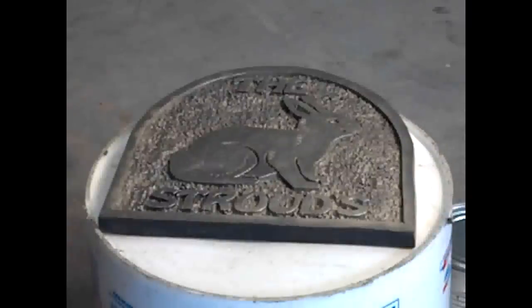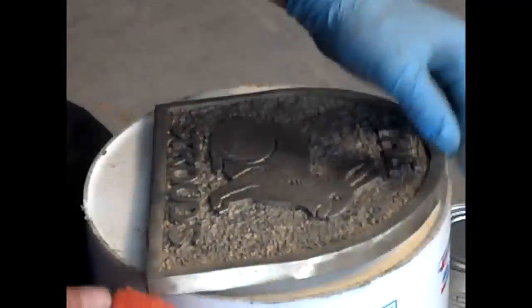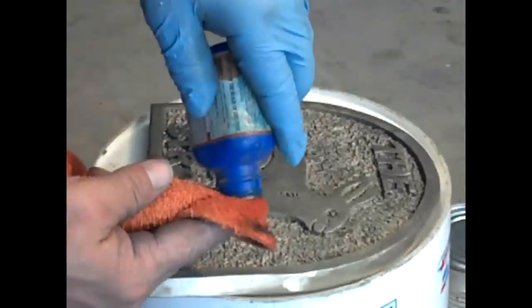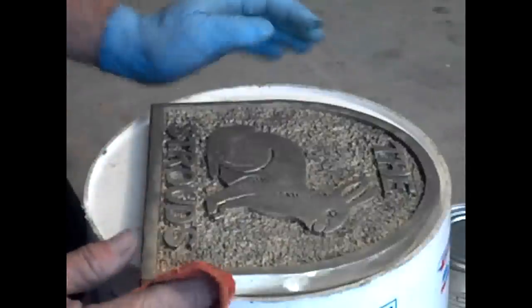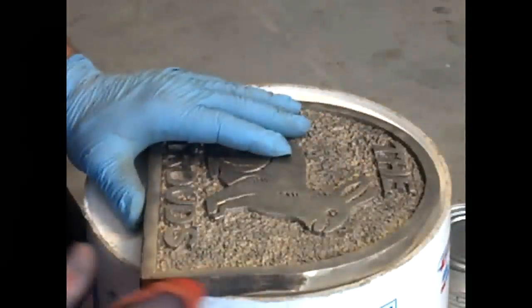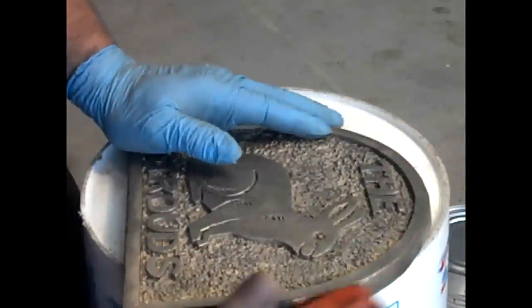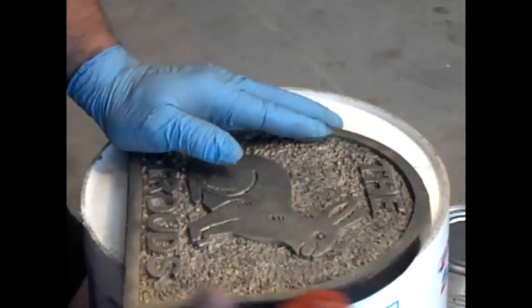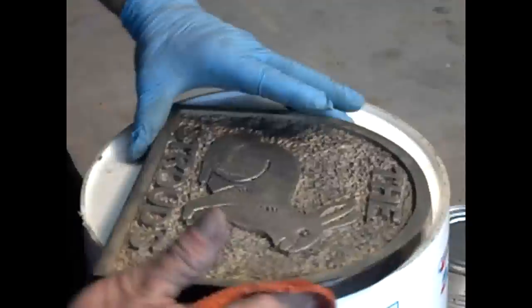See, now I'm going to show you how gun blue works. I put gun bluing on it to work as a base after I got it sandblasted. Just have the metal clean and get your cloth nice and wet. Put it on the metal and it turns it nice and dark. Then you rinse it with water, and you can rub it with steel wool if you want to get it to where you want the darkness that you want.